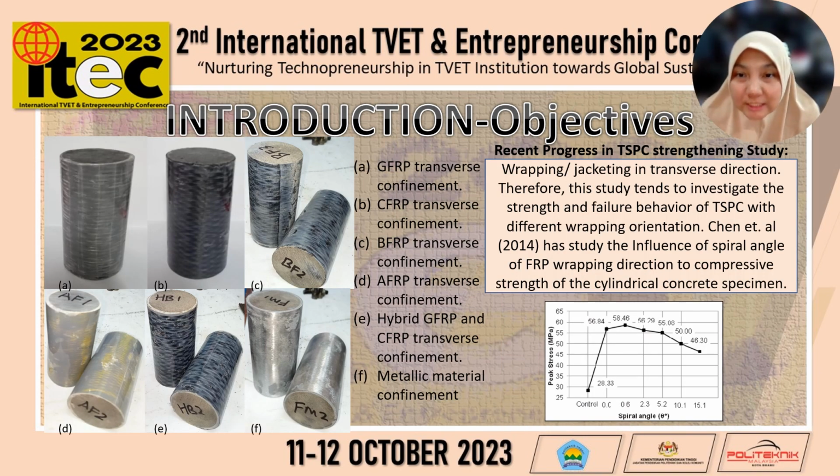Recent progress in TSPC strengthening study was through wrapping or jacketing in the transverse direction. The figure on the left side shows that TSPC has been wrapped using GFRP, CFRP, BFRP, AFRP, hybrid and metallic material. Therefore, this study intends to investigate the strength and failure behavior of TSPC with different wrapping orientation.